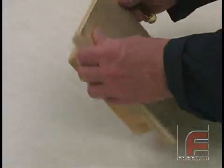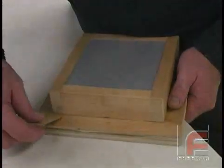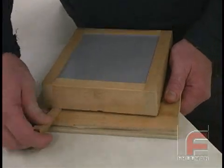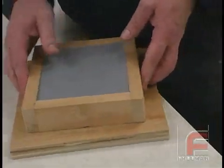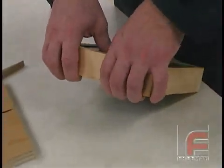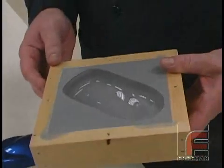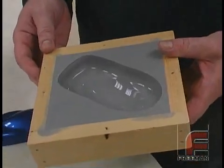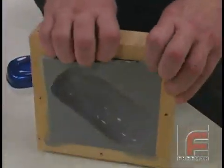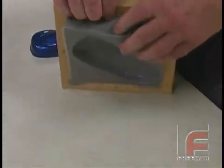Notice the larger bubbles that were introduced while pouring are already breaking on their own. The next day, our mold is ready. We remove the screws and then wedge the whole thing off with very little effort. Next, we push out our model from behind. Notice how accurately the silicone reproduces the surface of our model. Next, we push out the mold itself and pull off the edges with our fingers.